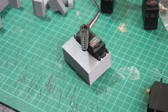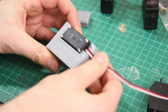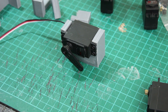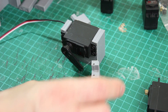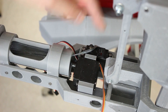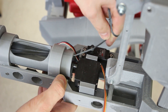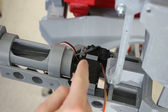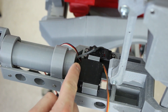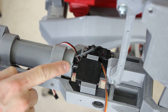I can slide the bracket up and down to get it in exactly the right place, then use one point on the servo horn to attach to one of the points I left in the back of the tube, and provided the center is in the middle, the tube should rotate fine. The other servo sits just to the side in the other orientation so its servo horn will spin this way and pull the string through the tube that pulls all of the fingers. Notches are cut for the servo cable to come out.